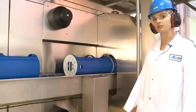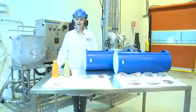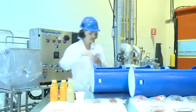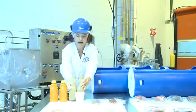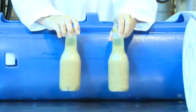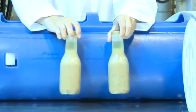I selected a variety of products to show different product types as well as different packaging types that can be used in high pressure processing. This is my high pressure processed juice and this is my non-processed juice — as you can see, there's no difference between the two products. We have salad dressing in a plastic-style bottle. With the geometry, we were able to keep the packaging integrity. The main considerations are that the plastic bottle can withstand compression and return to its original shape without any deformation or discoloration, and also that the labeling can withstand the water and pressure application.